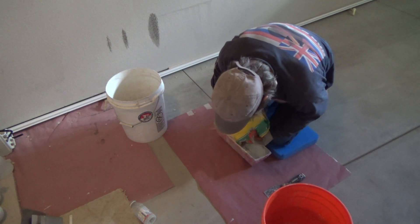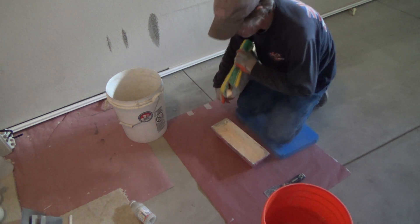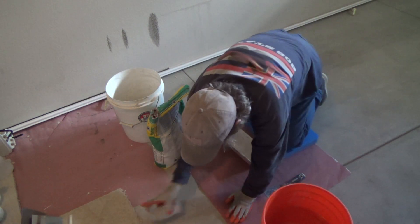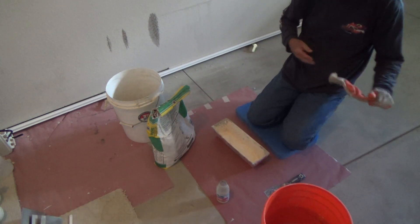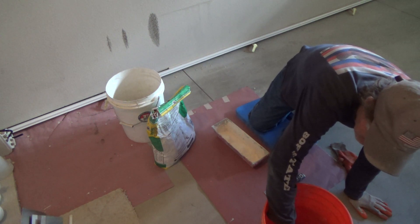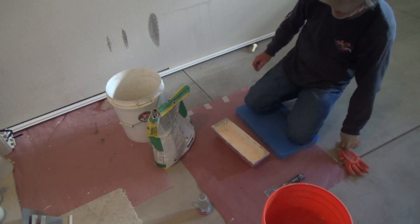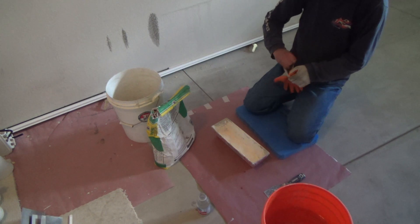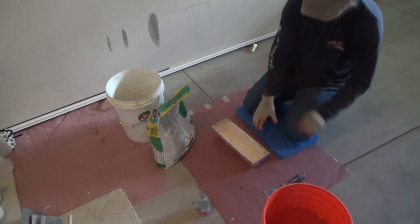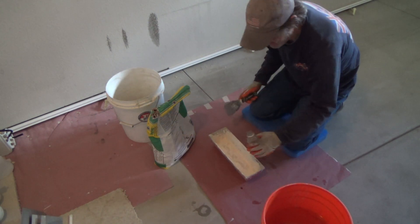I'm not going to put a whole lot in — I'll start with a little bit. I wouldn't use it to finish off the wall; it dries like quick set so you can only use it as an underlayment. I'm here in the garage with a piece of craft paper down so I don't get it messy on the floor. I'm going to mix it up here, and because it's going to be underneath where the tile ultimately goes, I'm fine with that.